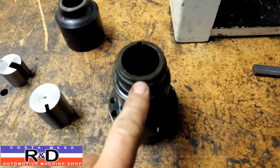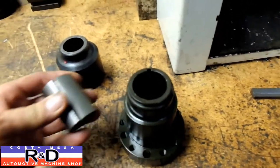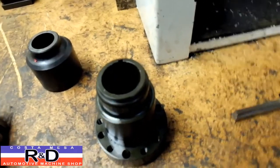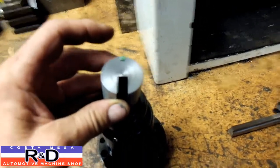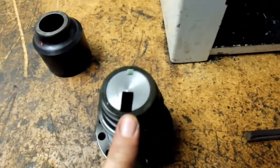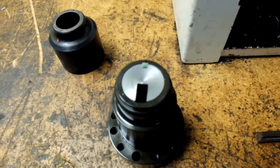We've already cut the crankshaft for the quarter-inch keyway, but we find that his hub does not have that feature. Normally when you cut a keyway, you're going to use some sort of a bushing like this to go in, and then you're going to use a broach to go down through and actually make the keyway. To get this so it's going to line up correctly, you have to make up something like this — you've got to have a slot here for your broach, then you have to have a keyway at the top so you can align this correctly, so that when you run the broach through, this is going to be directly in line with the other keyway up here.